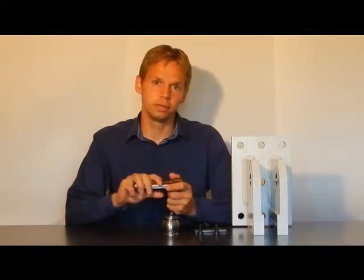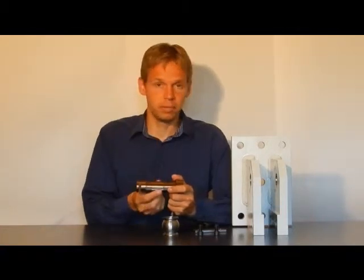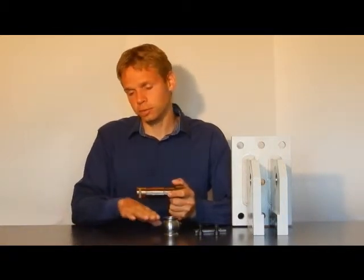First, the TARA function. The TARA function gives you the possibility to mount the load pin and put a load on it. Maybe you have a part of a machine with 10 kN — you have a signal of 5 mA. But you want to have 4 mA, as in a scale where you put a bowl on it and want to zero the signal. With a TARA wire, you connect to 24 V for one second, and then you have an output signal of 4 mA.